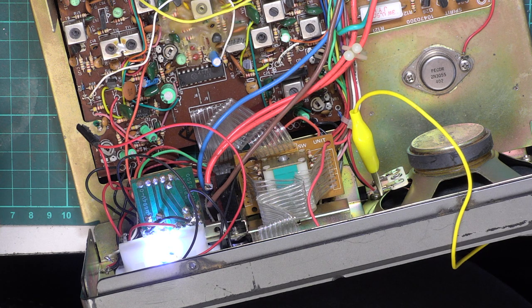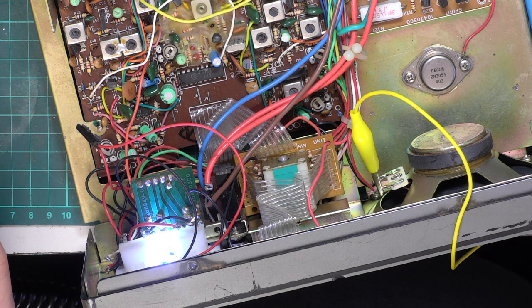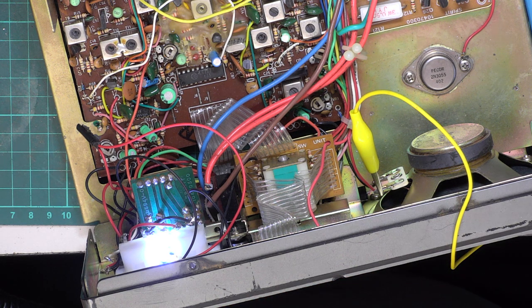So let's do the squelch. We'll park the signal generator at 0.3 microvolt, and we'll move the camera onto the controls of the attenuator. So you know I'm not telling you porkies. Right, so we are parked at 0.3 of a microvolt. So I'm going to switch the signal generator off and set the squelch to minimum, to threshold. Switch the signal generator back on. And it's come in. We can make it go off at 0.27 of a microvolt and come on at 0.31.